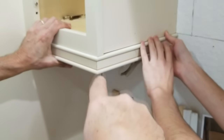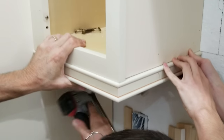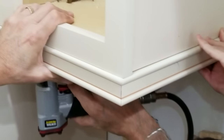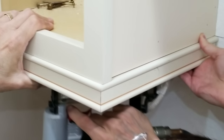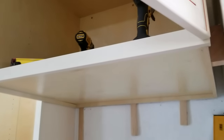We've got the light rail corners here — you can see the two pieces going on the bottom of the cabinet, forming them at a 90-degree angle. Always put a little bit of glue in there, then use a little triangle-shaped piece to wedge it in. When installing the light rail, fill that small corner gap so it's as tiny a crack as possible, then nail it into place. Under here we have blocks on the underside — nailing blocks — so you brad nail the light rail into those because you can't nail right into the bottom of the cabinet.